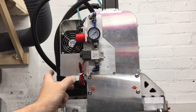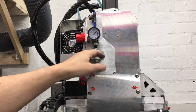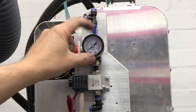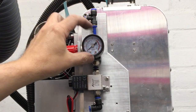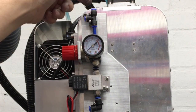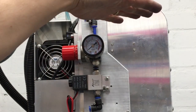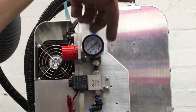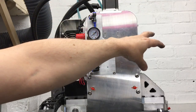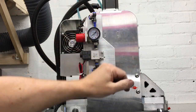So this is what we've got so far. The air will come out of the compressor, through the regulator, goes to this point here, through this elbow, through the solenoid - controlled either with a push button or from the CNC machine. When this is on, air will come through here and then be limited down to about 20 PSI. Goes to this T-piece that splits in two - one will go into the filter bottle and put pressure on the fluid to push it down, and from the bottom will be a pipe feeding that liquid into the mixer block.